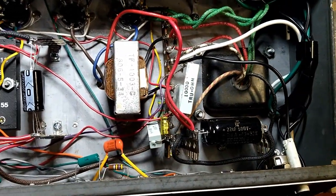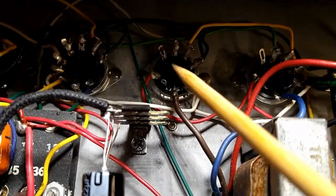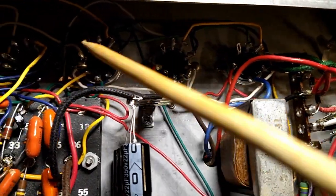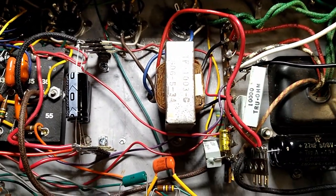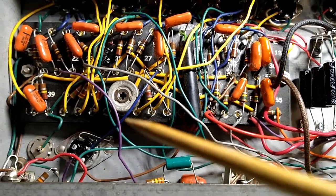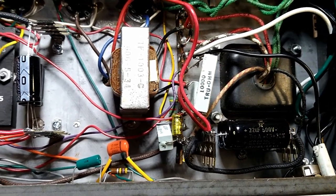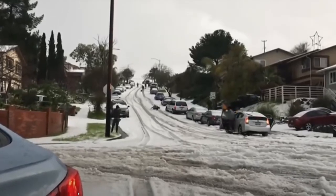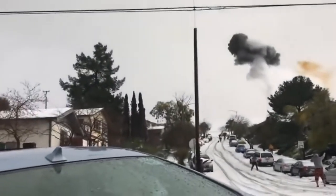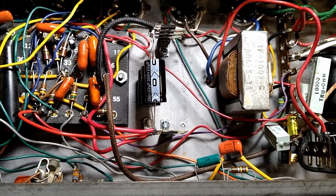And so what I think I'm going to do today, probably what I'll do first is rewire the black and white wires here. You can see through the shadows. I'm going to rewire the heaters. It's a known issue. I mean, it's just a big giant antenna for noise. So probably rewire those and I'll fire it back up and test the voltages. See if there's any DC leakage through caps, stuff like that. And then we'll do some investigation and some learning. See if we can't figure out why we've got lightning storms inside that power tube. But one thing at a time. So, here we go. Enjoy.